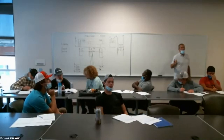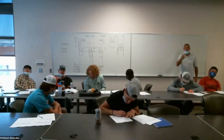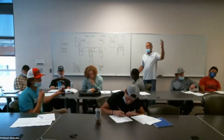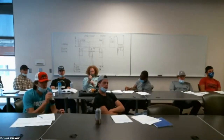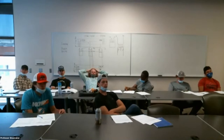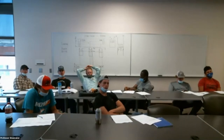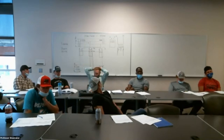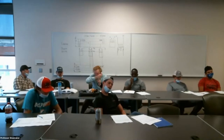So, I have completed it on the board, and I'm getting ready to erase it and go back to Professor B's method right here, because this is what's going to happen out here on the board. He put an actual meter base, so this is what's going to be going onto whatever the business is. You'll notice on the left-hand side, step up here real quick. You guys online, if you bring up a picture of a three-phase meter base, they're all pretty much the same. This is neutral, this is one hot leg, this is the next hot leg, this is the next hot leg. How many wires do I have coming out of my transformer? A, B, C, N. Four. So this is what's going into whatever we're trying to feed right here. Neutral is always going to be on the left-hand side.